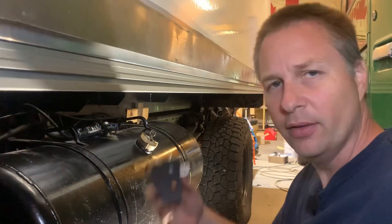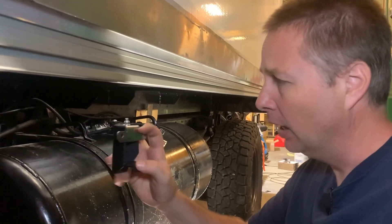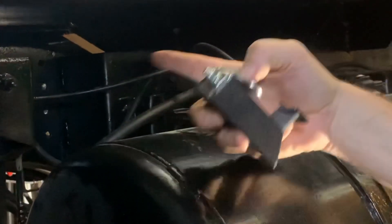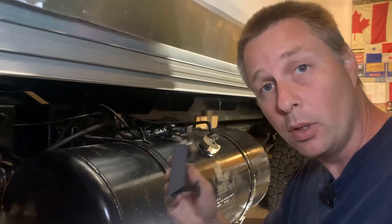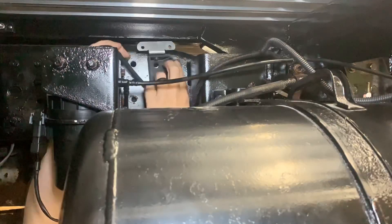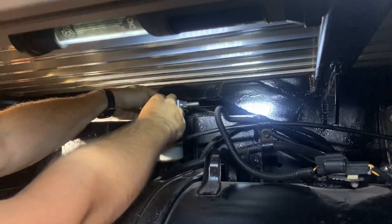Well, that didn't start out too well. I haven't even got the first bolt in yet and I realized I need to make another revision. Luckily I can still reuse this bracket — I just need to flip over the metal bracket because all my lines are directly in line with the structure on each side. Not really a big deal; flipping the bracket over actually gives me better access to the nuts on the backside and better access to the bolts from the front side. That's the best part about 3D printing — I just go back to SketchUp, modify the file, and print another one. But for now this one will work to get us to the point of the system being complete, and it's easy to swap out later. If you follow the link to download the file for this or any of the other parts I list there, I'll always upload any future updates so you'll get the most recent file.